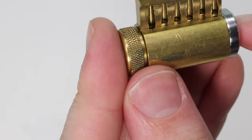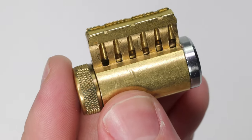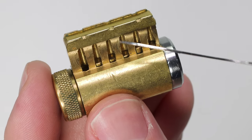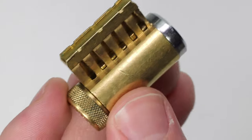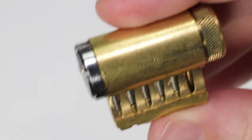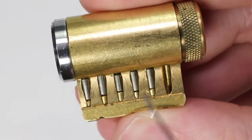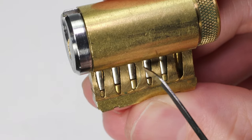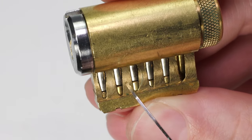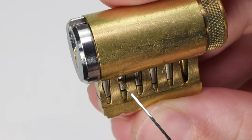Now when I go to rotate this lock over 180 degrees, I just want you to bear in mind that if we did have all good springs in here they would be occupying a little bit of space. Because when I flip this lock over 180 degrees — since I do not have any springs in there at all — a lot of these key pins are now sitting below the plug, so you'd be able to just open up the lock without anything. Luckily this one key pin here is long enough so it's going to obstruct the plug.